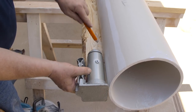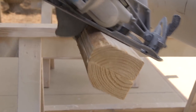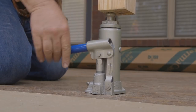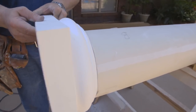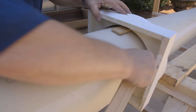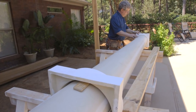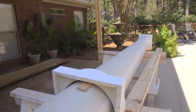You will need to raise the support beam using the two 2x4s nailed together. Cut the 2x4s to fit between the hydraulic jack and the beam and then use the jack to raise the beam approximately half of an inch. Take the Tuscan base and slide it onto the bottom of the column shaft. Temporarily tape or shim it approximately 24 inches up from the bottom of the shaft. Slide the Tuscan cap over the top of the column shaft and let it come to rest on the neck ring. You are now ready to install your column.